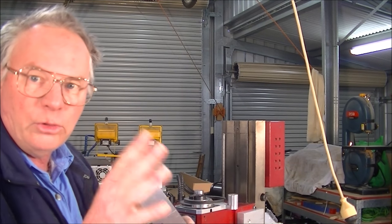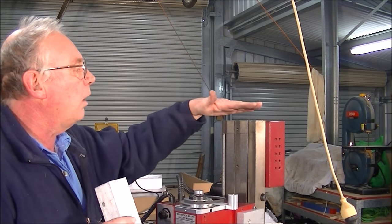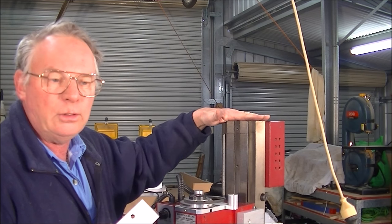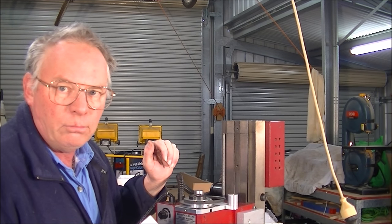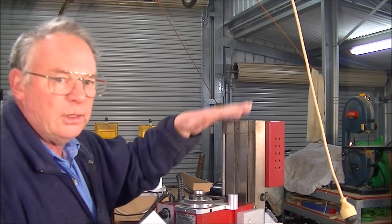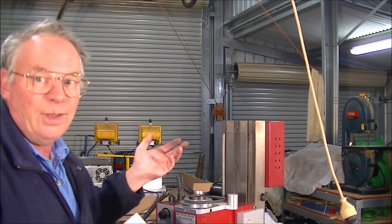And that's how I'm going to produce the unit. Because, like I mentioned earlier, the top of these pillars are not machined, should we say, perfectly square. And to strip this down and put it onto another mill and machine it totally square, it's a fairly big deal, especially if you haven't got a mill.